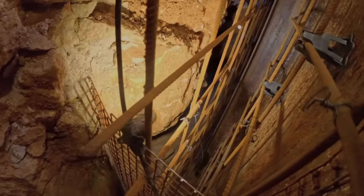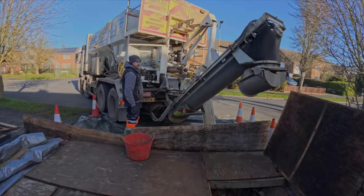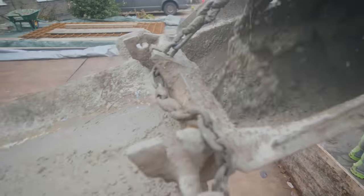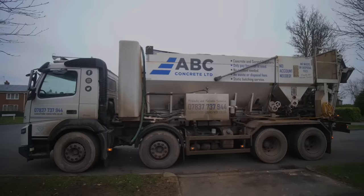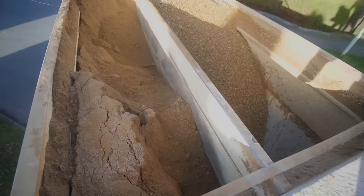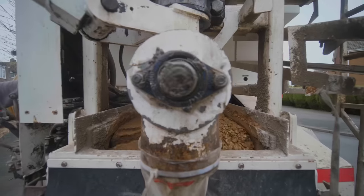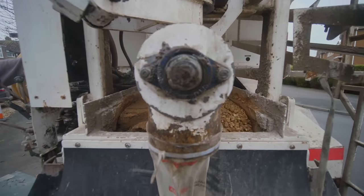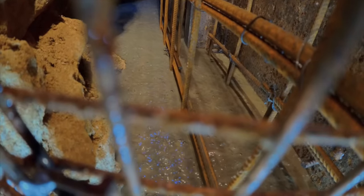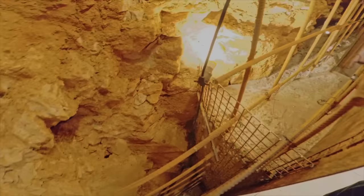With the secondary layer fitted and spaced off, it's time to fill it in with concrete. It's very difficult to know how much concrete you're going to need, so for this project we've been using a volumetric mixer — basically a cement mixer with separate bays for sand, gravel, and cement. They come down a conveyor belt and mix at the entry port. You can use as much or as little as you want, and make it as wet or dry as you want, or change it halfway through the process. This is ideal for getting the concrete flowing at the right consistency and to the level we require.